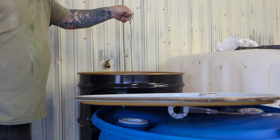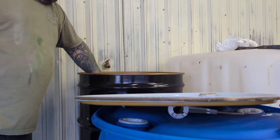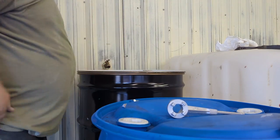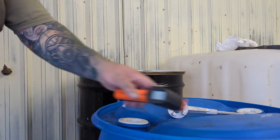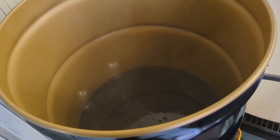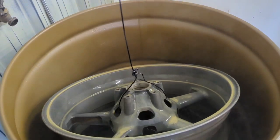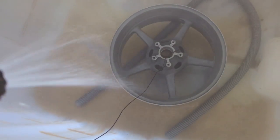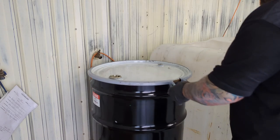Some of you are probably asking, what about just a common plastic drum like we've seen chemicals like this come in before? Realistically, the answer is no. This product does require heat to work, and a plastic drum is not going to be your best option. You could likely get away with a submersible heater and a plastic drum, but those will end up limiting your working room inside. There's something about hot chemicals in a plastic drum that just doesn't make me comfortable recommending it. I haven't asked PowderStrip if that works, but I would look into it before you even consider that — the limited space and hot liquid in plastic just feels wrong.